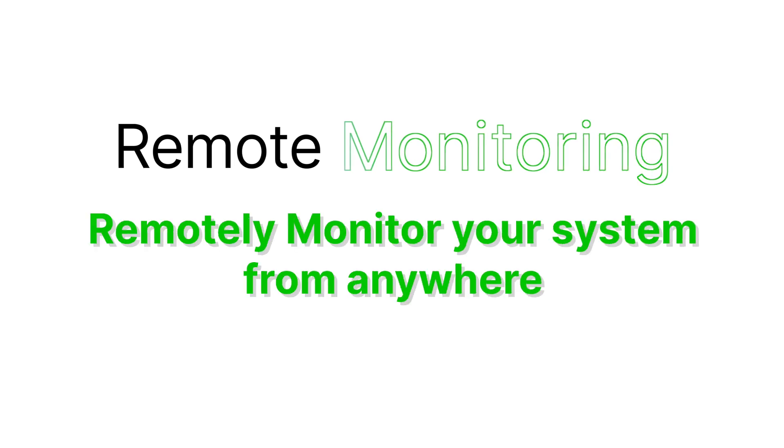Remote monitoring options — a must-have for remote locations. For solar-powered camera systems in remote areas, having remote monitoring capabilities can save you time and effort and provide real-time charge status updates online. Most popular solar charge controllers only allow Bluetooth monitoring, which has to be done on-site within about 30 feet from your devices. For true remote monitoring, you'll need to consider solar charge controllers that support cloud monitoring.